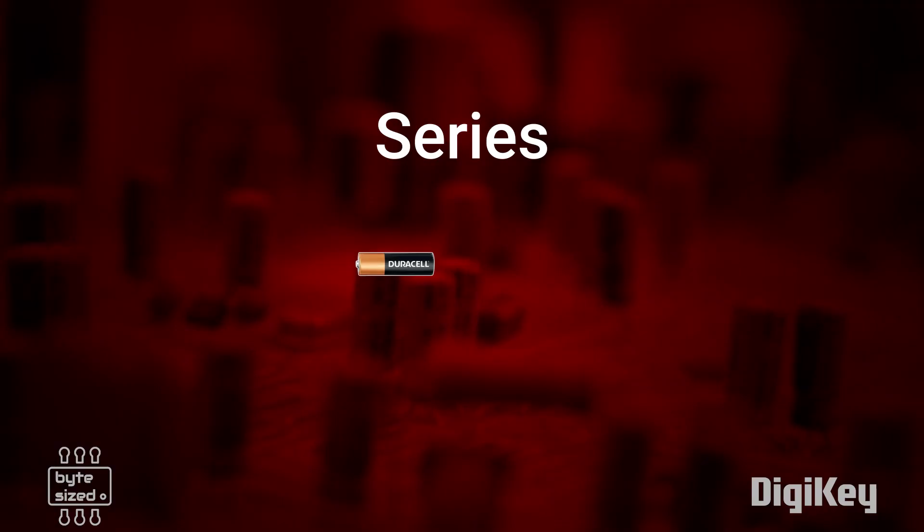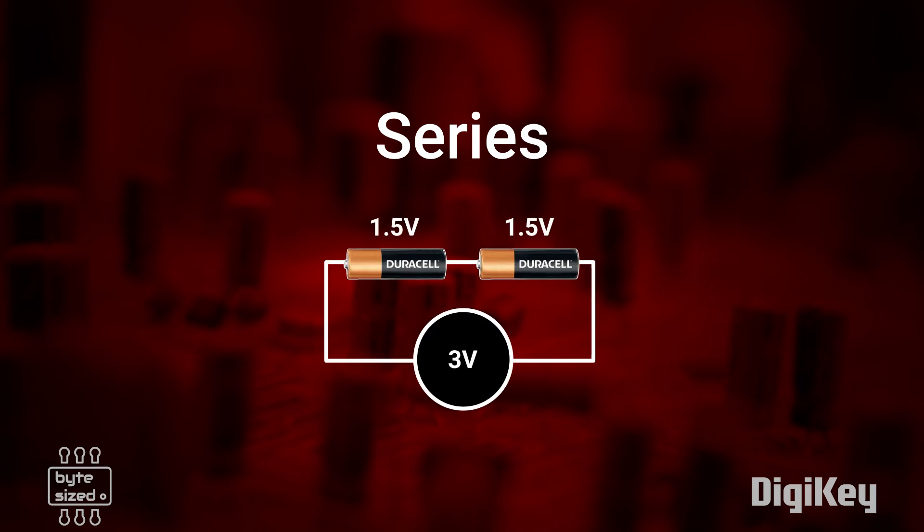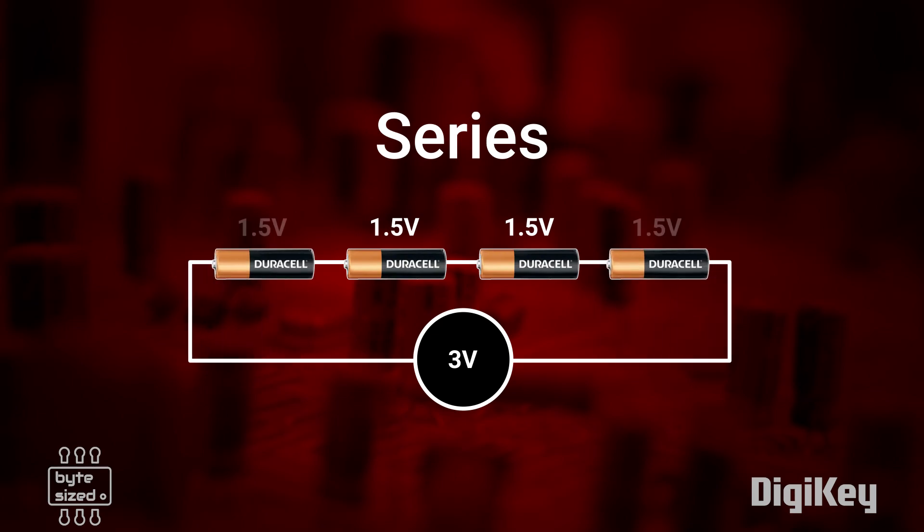Of course, if the battery is fully charged it will be a little bit higher than the nominal voltage, and when it's fully discharged it'll be a little bit lower. If you need to increase the voltage of a cell, you can put two or more in series and that will increase the voltage. When you put batteries in series, the capacity will stay the same but the voltage of each cell will add up. So if you have two alkaline cells, the voltages add up to 3 volts, or if you have four alkaline cells, the voltage would add up to 6 volts.